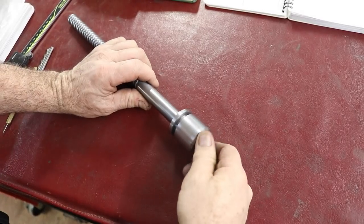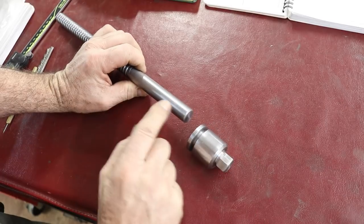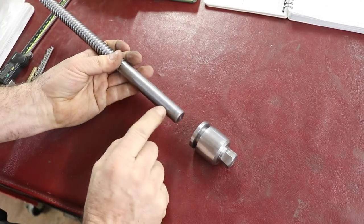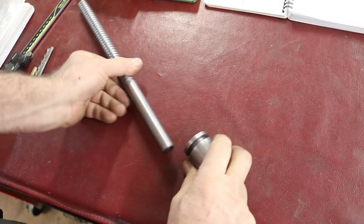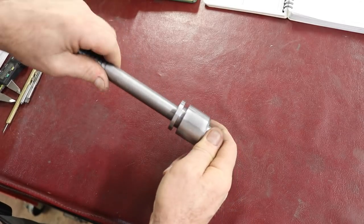Here's our part. I have a really nice piston fit on this. I just polished it. I cut it to length first, and then I just cleaned up, faced off, chamfered, and just polished the end a little bit, and we came out with a perfect piston fit there.